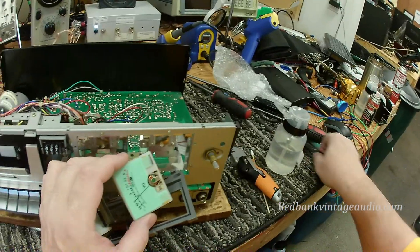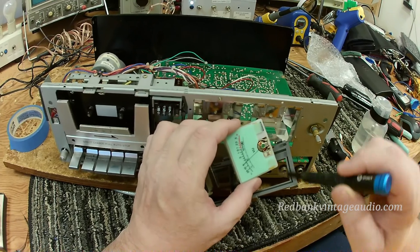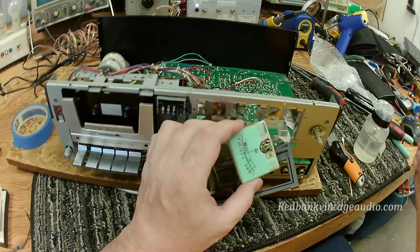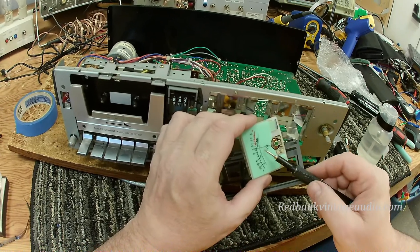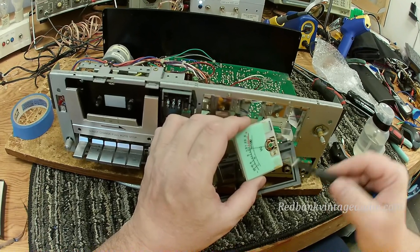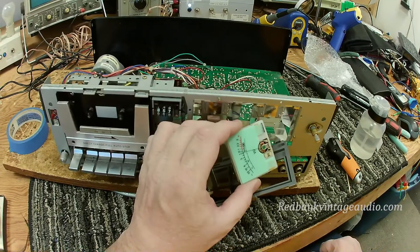So there is an adjustment screw here. This type of movement is called a D'Arsonval movement. It has a voice coil like a speaker around a circular magnet, and when you run current through the voice coil it moves like a motor. What's happened is somehow or another this has gotten too tight and it's gripping the needle bearings of the needle. By the way, the needle bearings and needle are not related — the needle bearings are called that independent of the fact that they hold a needle in place. In any case, the needle bearings are too tight and it won't let it move.